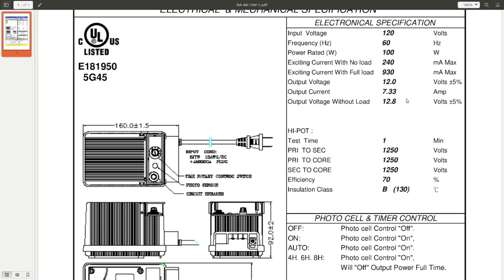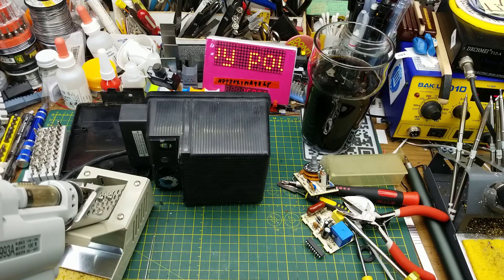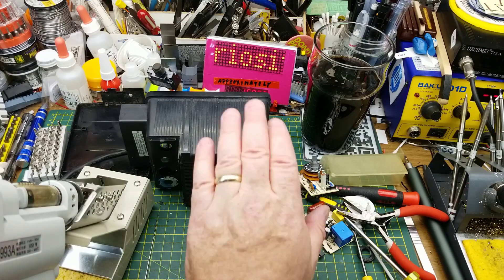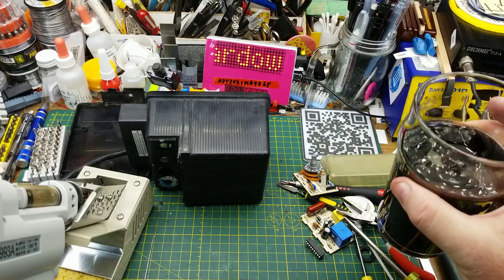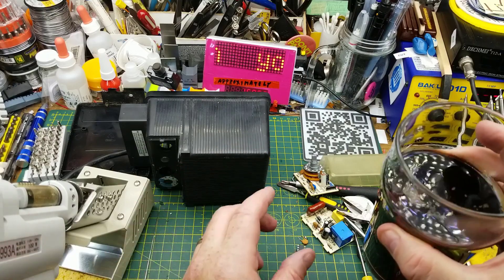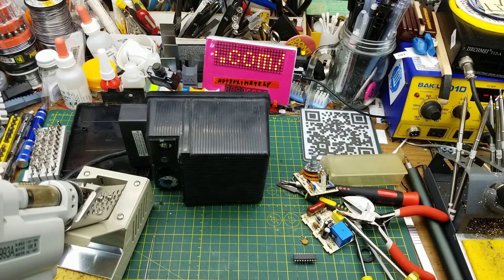So 7.3 amps at 12 volts is going to be very useful for powering pretty much anything - just make a linear regulator after it for DC if I want to run masses of LEDs or something. I do like having old-school analog power supplies with linear regulators rather than switching, because as I saw a few videos back, all these switching power supplies generate so much electrical noise, and I don't need that when I'm trying to figure out a circuit and look at it on the scope. With this I should be able to build power supplies that don't create all that excess noise. Thanks for watching - that was kind of quick and a little anticlimactic because of this anonymous little IC. Questions and comments down below as usual, thanks for watching.